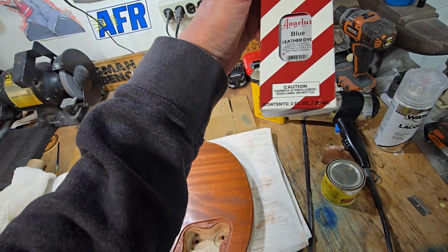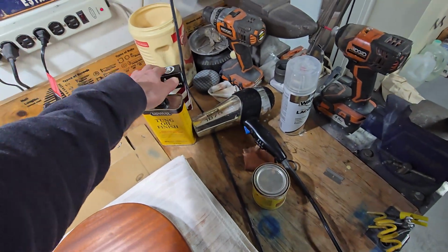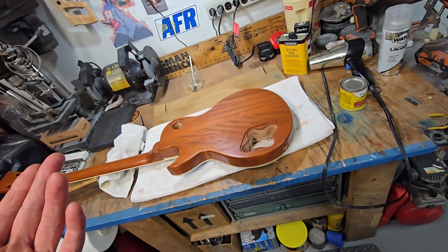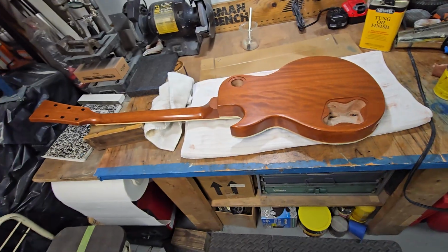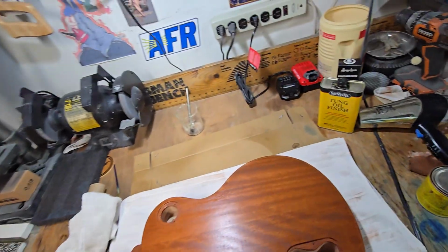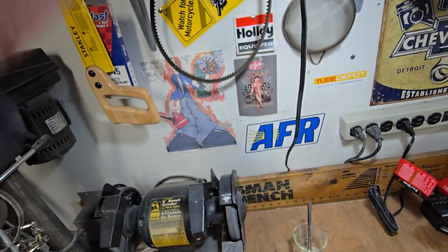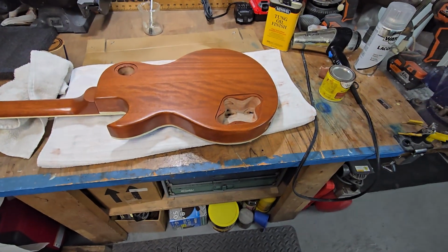This is a denatured alcohol, so I use denatured alcohol to cut it. I didn't use regular alcohol, because regular alcohol contains a lot of water, like 30%. There are different ones, 80%, 90%. The denatured seems to work pretty good, and it breaks it down. There's no spotty clumpiness in the stain, which I know you'll get if you start mixing water with some of these stains.